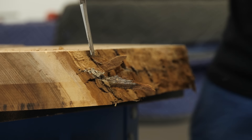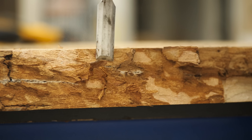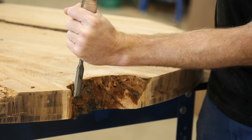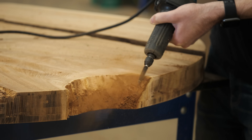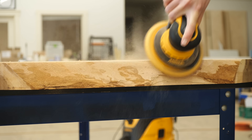I know things are looking kind of rough right now. Here it might look like we're just hacking away at the edges, and you're right — we are. But that's only because none of this matters. The circle that we just routed out is still slightly oversized, so you're not going to see any of those edges. And all of these edges are going to get covered in epoxy, so you're not going to see them either.